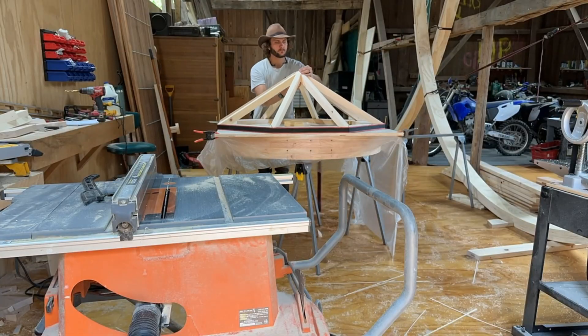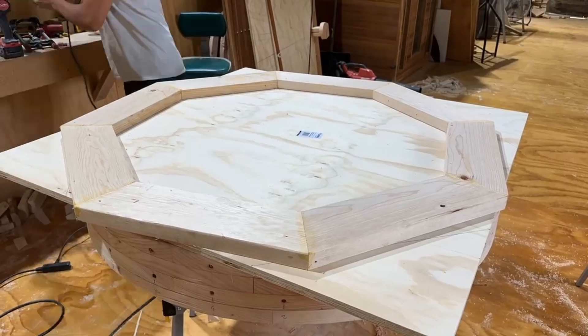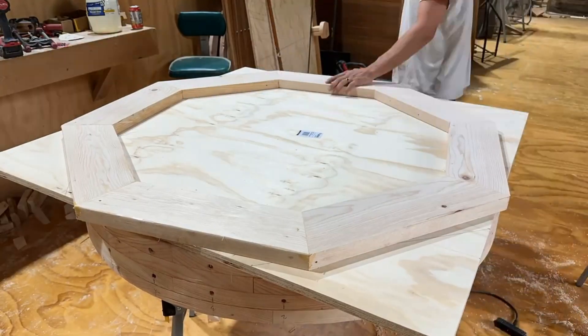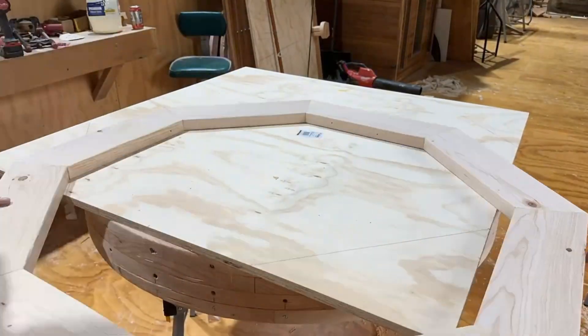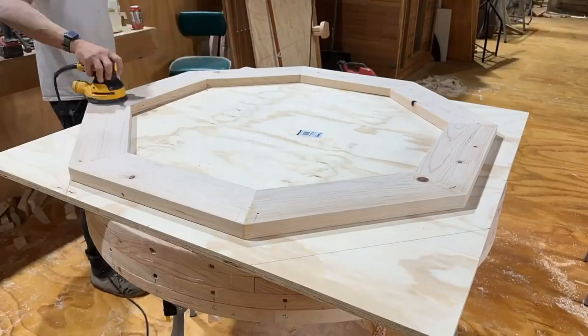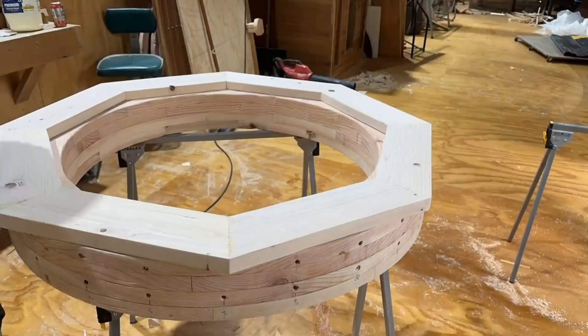I'll take a second to walk around and appreciate how this thing is coming together, and admire my own work before we turn to the task of sanding and prepping for stain. The stain is an optional step, but I'm matching the look of the natural red oak lattice, and I have stained the compression ring and rafters to match. As I wrap up staining our octagon base, you can see how it looks sitting on the finished compression ring — the circle sits perfectly flush with the edges, with the points overhanging.